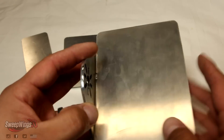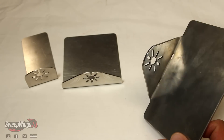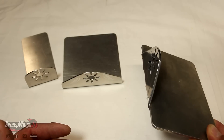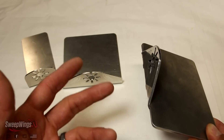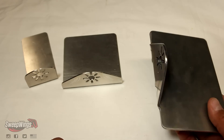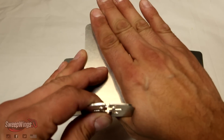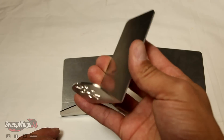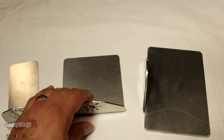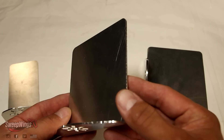It's heavy-duty aluminum, and once you scratch it up and glue it to the bottom, these have been on my builds since I started. We've progressed from older kits where I was cutting everything by hand with snips and a shear — now we're CNC'ing them and stepping up the quality. Being a little bit longer gives you that much more strength on the Runt, and this doesn't really affect CG. You just want that bite — all of this right here is added strength on your wing.